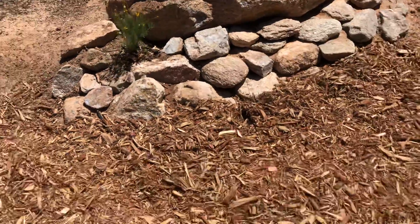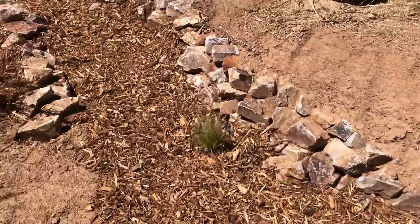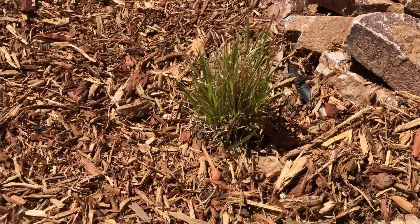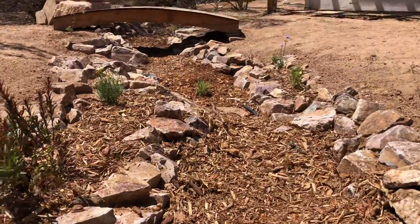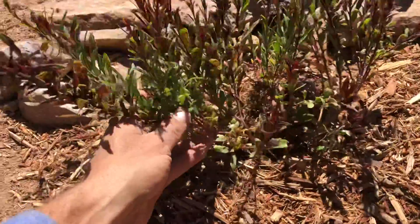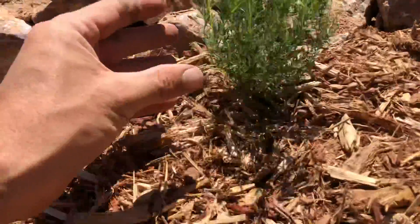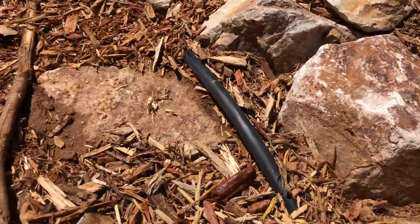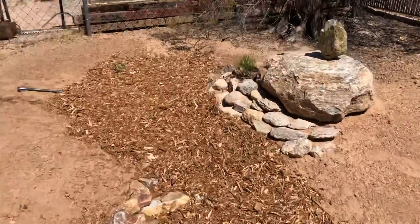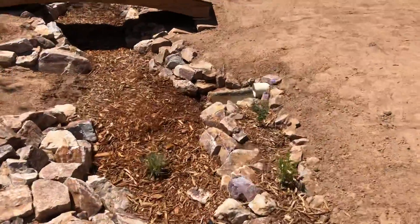Rock work is finished. Looking at the basins — grass is down here in the bottom. Grasses grow big, bunchy roots that go down deep in the basin, help break up the soil, and let that water drain well. We've got a couple of different grasses down on the bottom shelf. All of these plants are native Sonoran and should do very well here in this climate. The irrigators here are part of a poly line that runs down the middle of the basin, intended to be just a trunk line for establishing the roots. Once they've got their feet in the ground, we can turn off the irrigation and let them do their thing, because the soil will be more prepped and water will be caught.